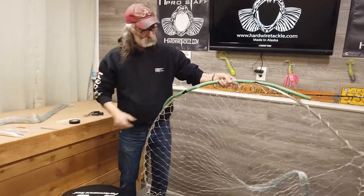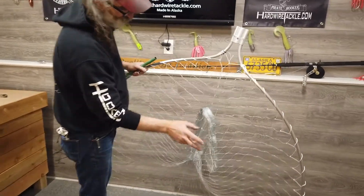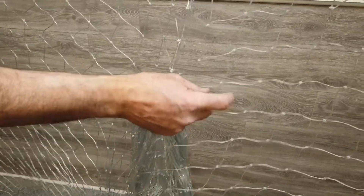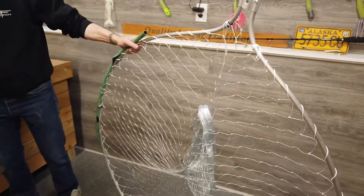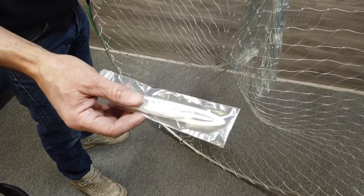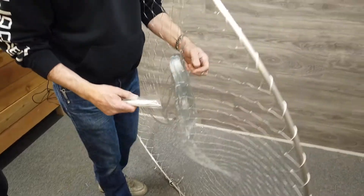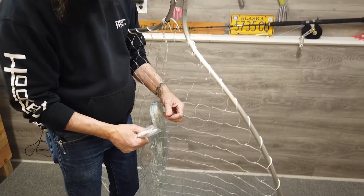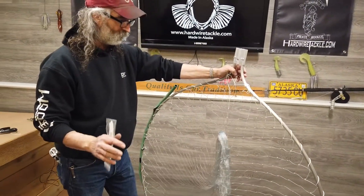Now at some point you may be getting into the fish, you might snag it on a rock — something's going to happen and you're going to start breaking what we call a bar. That makes a nine inch hole at that point. So what you'll want to do is have what I call a repair kit — it's lighter line than the rehang kit with a couple zip ties in it. A couple things you can do is gather up from side to side, lace it up, throw some half hitches in it, pull it tight and it will repair the hole and get you through the drift or the day.